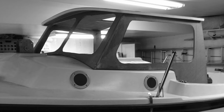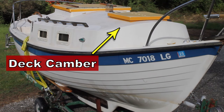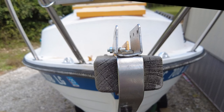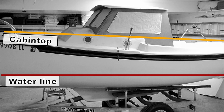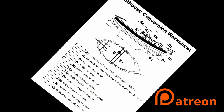Here's where we start analyzing the lines of the boat. When taking these measurements, you need to be conscious of the camber of the deck — that's the curve of the deck from the centerline outboard. We need to know what's the drop from the centerline of the boat to the sides of the cabin top; it's basically an arch where the center is higher than the sides. I like to take a measurement from the deck to the top of the cabin top on the sides and in the center, which gives me an idea of the drop. We also need to know how much fore to aft the cabin top slopes in relation to the waterline, and what is the rake of the forward cabin edge. All of these dimensions I make note of and put into a little worksheet.